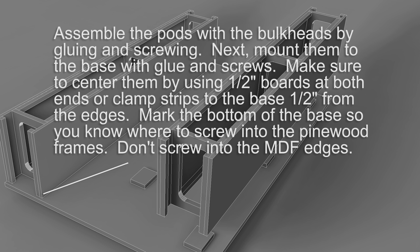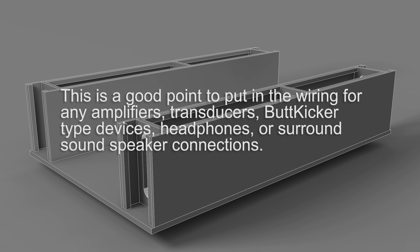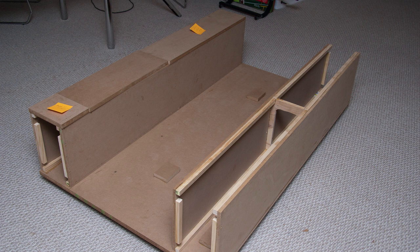The bulkheads — in my prototype I only had one, but the design calls for three. It's up to you; three would make it easier to do the next step. When you plant these things on the baseboard, just remember you don't have the front and back board there, so you need to take that into account when you align them on the baseboard. You'll also need to flip this unit over to screw them in, so make sure you mark the baseboard from the bottom.